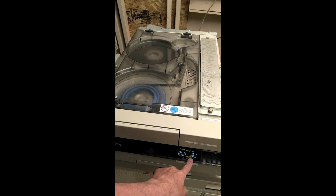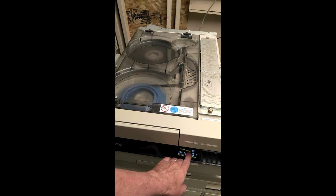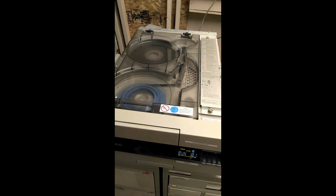down here it's showing us how far it's gotten on the tape. So there's a segment display right down here. And it's saying the tape is, sorry, you probably can't see this. This little indicator light here is saying write enabled, what the density is that it's doing. Now it's rewinding the tape, and these tape drives could read tapes backwards. In other words, if it had a big enough buffer, it could read the tape while it was going backwards, and then just transfer the data in order when it copied the data from the tape drive to the actual system. So I actually don't know which of that it's doing.